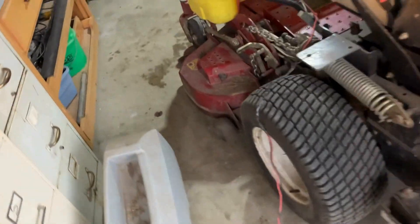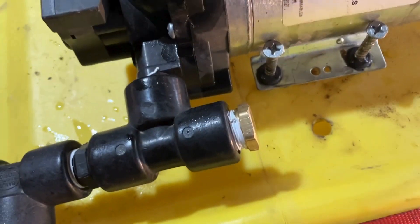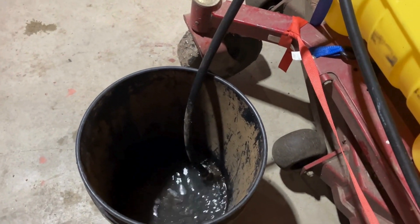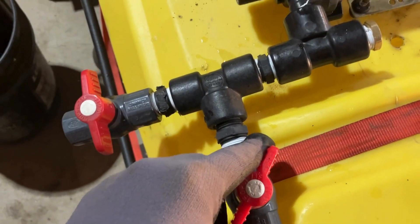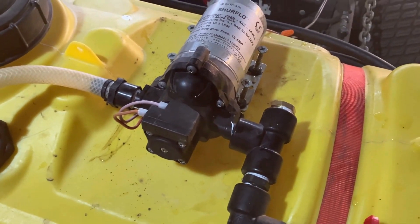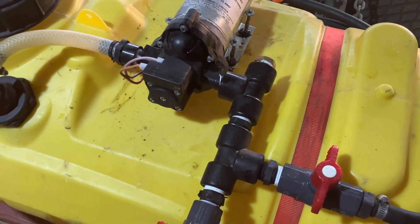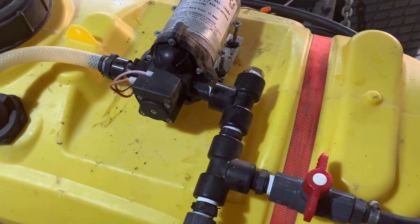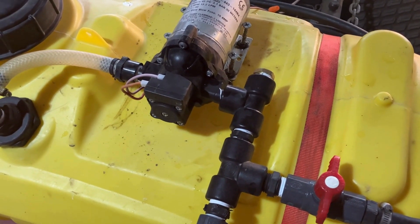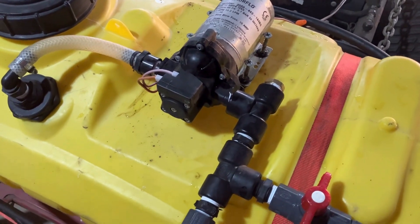A final test: we plugged off the port where the regulating valve was. The pump is running and water is pumping into this bucket. If I shut this off, the pump completely shuts off — so we know the switch is working and the pump is working fine. We know it's the regulating valve. Unfortunately, cleaning it up — even though it looks good — it's not shutting off. I might try cleaning it more with soapy water and letting it dry overnight, but I'm fairly confident that is the issue.